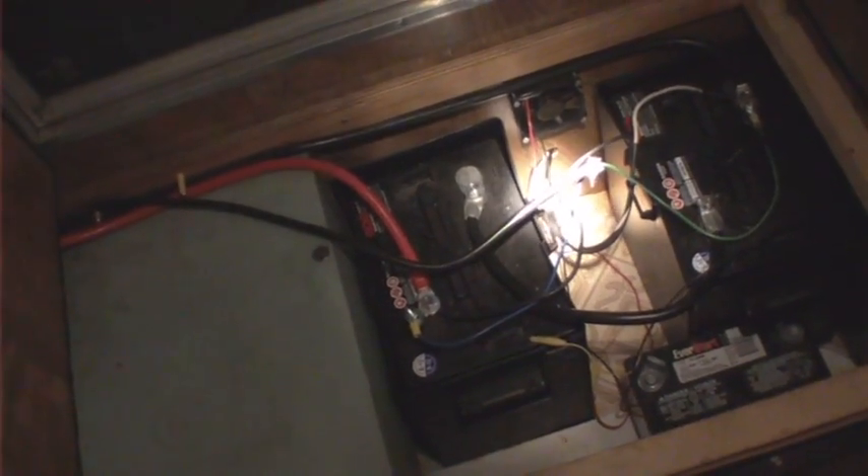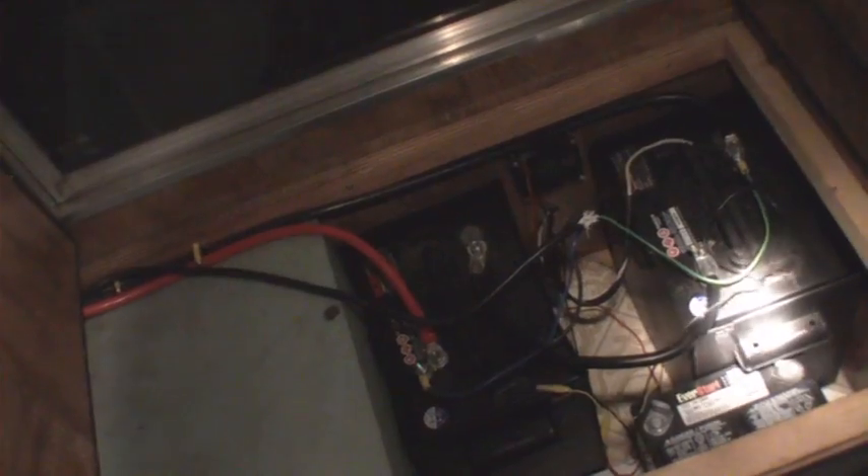It's on an 8-gauge fuse assembly - you know, those giant fuses. I'm running a 60 amp, but I probably should be running a 40 amp fuse. What happens is if you let these discharge fully - which I won't have that problem because I've got solar panels on the roof - but if you let those down to 11 volts and then your batteries up front are at 12.7 or something, when you turn the key on your ignition it's opening these batteries in parallel to the running batteries, and you get an inrush of current that's astronomical. You'll probably blow a 30 amp fuse easy. That's why you want to make sure you use an 8-gauge fuse assembly with large fuses.